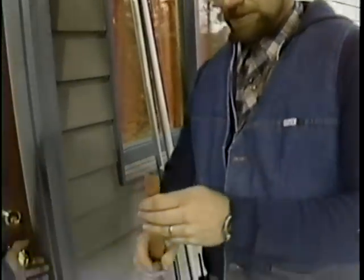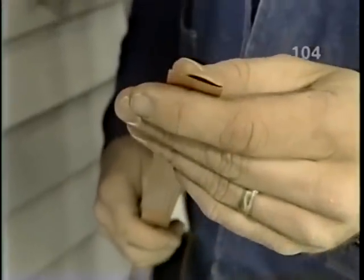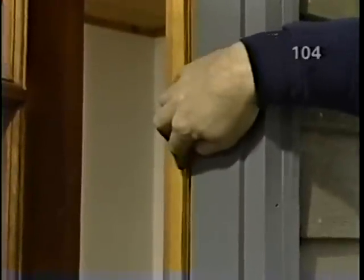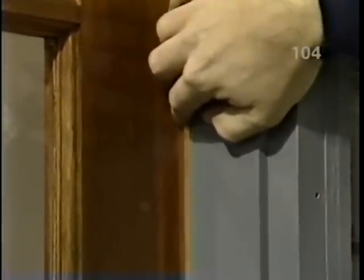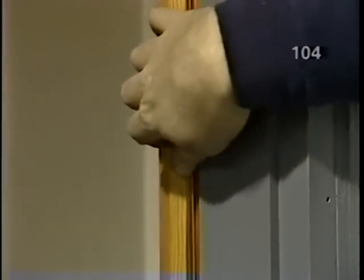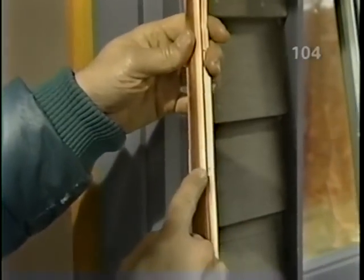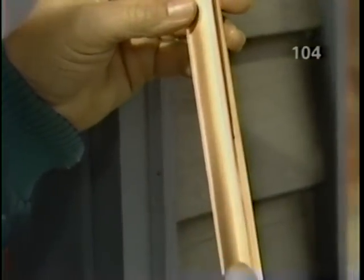One of them is this spring metal V channel, which the door will seal against, and that gets installed in the jamb, on the inside edge. And then as the door shuts, it'll put pressure against there. Exactly. It closes it on itself. Okay. But they're not very easy to put in place because there's not much room to actually hit the nail with the hammer without banging this side up. That's right. And once you bang this, it doesn't seal very well.